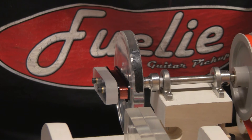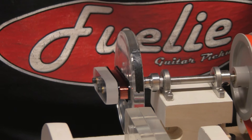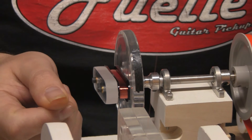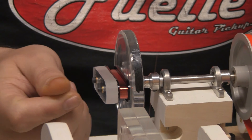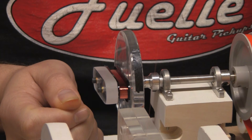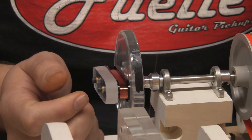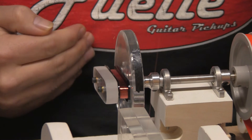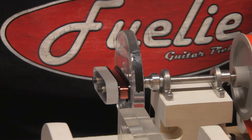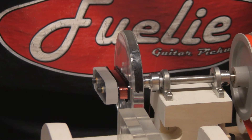It's a neat pattern as it's laid down, and it's not necessarily a scatter wound. It's more like a hybrid of machine and hand-guided because I don't have the diagonal movement. When you're hand winding, typically they're moving their thumb back and forth on a piece of bar stock, moving the wire back and forth — actually kind of whipping it a little bit. You're trying to move the wire back and forth over something a little wider than a quarter inch, unless your slide point is moved back farther. As you move it back farther, you can set your traverse limits wider apart, which gives you a little more detail for a neatly wound coil, but you're still going to get the whipping effect.